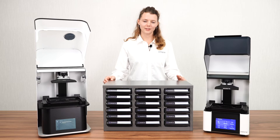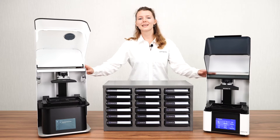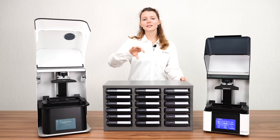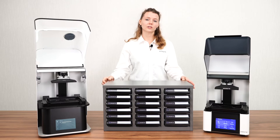Today we're going to talk about vat management. It makes sense to buy multiple vats for your printers because it saves you time if you pour your resin in one vat and then don't have to clean it right away. Also that way you can avoid contamination.